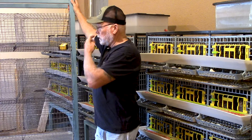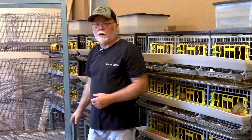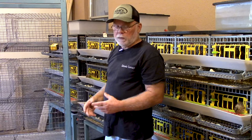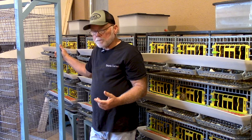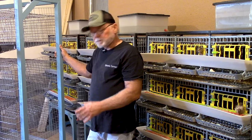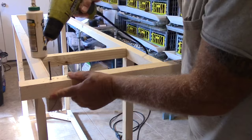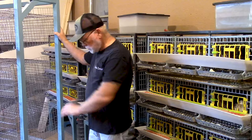You're going to take your 35 and a half inch pieces and mount one at the top and one at the bottom, lining it up with the side pieces — or if you want to measure, it's 16 inches off the ground. I also screw down some scrap pieces at the bottom — you can use 2x2 or boards from an old pallet — just to give it a base and stabilize it a bit. It'll also make the cage less likely to tip forward or backward because you get a wider foot base.